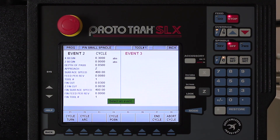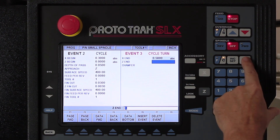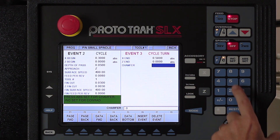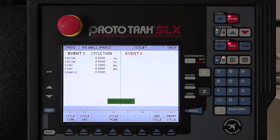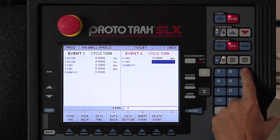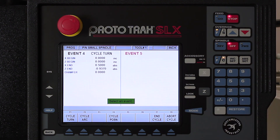Now that I've filled out that first event for the cycle, I'm just going to describe this part piece by piece. I'm going to do a turning event and come out to my first finished dimension, which is a half an inch — 0.5. My Z is going to stay at zero. Here it's asking me to put a 50 thousandths chamfer on the corner, so I'm going to put 0.05 and absolute set for a chamfer. My next turning event, I'm going to keep it at 0.5 and go all the way to the other side of this groove, so I'm going to go minus 0.937. The chamfer command doesn't apply right now, so I'm just going to leave that.